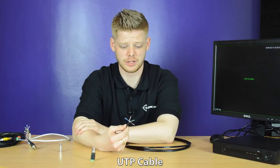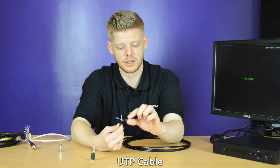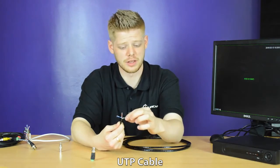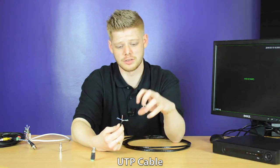If you use this cabling to have several different things attached to it, we would always recommend using two twisted pairs for a power balun. The reason being is it's a thicker wire and so it would carry the voltage further with less of a voltage drop.